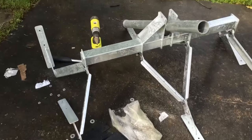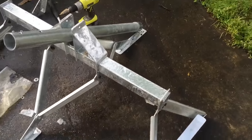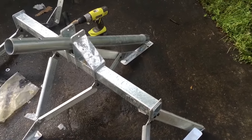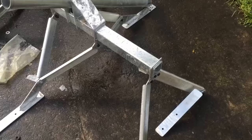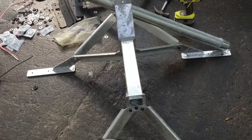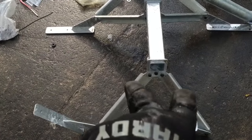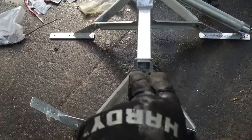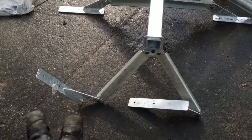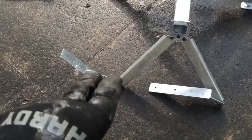Just a few last things on this mount, then I'm going to climb back up on the roof and show you the turbine sitting there before we put the blade sets on. These mounts — the flexibility of them — you can set the pivot on it. So a 4/12 or 4/6 roof pitch, it doesn't matter. The best thing to do is find the angle that you want and leave these loose until you get up there.